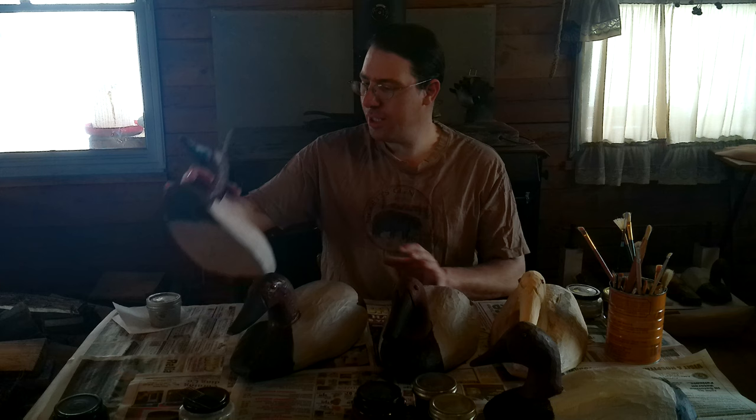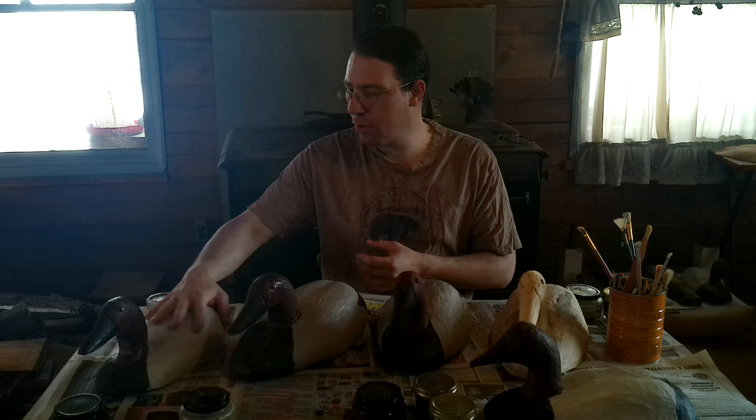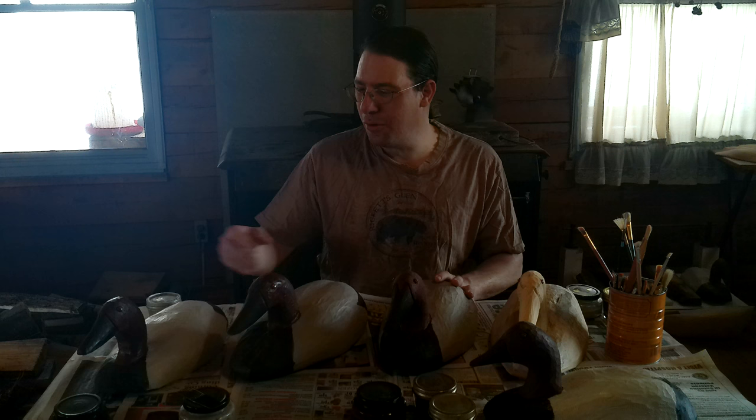The white is titanium oxide, which is perfectly safe, but it's not nearly as good a catalyst as the iron. There's only traces of the Japan dryer in the boiled linseed oil, so it's very slow drying — about a week to dry to the touch. The darker iron oxide based pigments — the red, black, and umber — dry in two or three days, while the whites take much longer. Also I'm not using pure white; this looks white but it's really a very light gray, painted over a darker light gray, giving a slight two-tone effect. My white is dirtied up with just a tiny bit of umber to make it a little eggshell, a little off-tone.